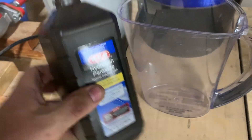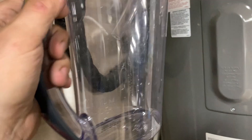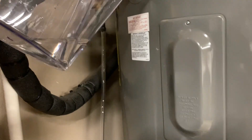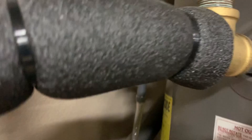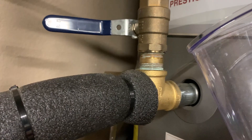So when it comes time to fix my water, all I've got to do is take some of this hydrogen peroxide and pour it in here so you can get a visual. I don't have a lot in here — it doesn't take much to fix it. Then I put the tube into the bottom of the hydrogen peroxide, and with the other hand I lift that valve, open up the vacuum, and it sucks that in real fast.